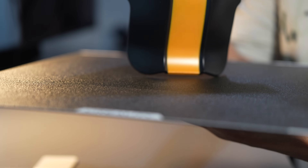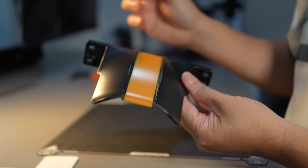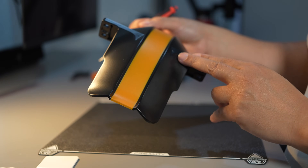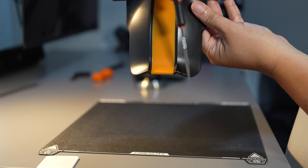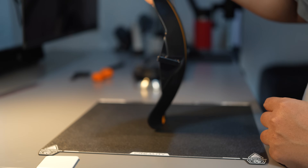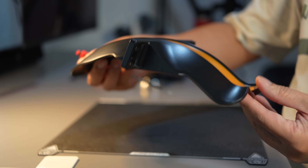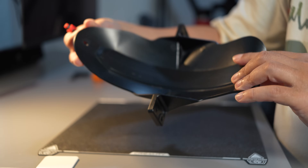If you look closely, this end of the mudguard is not flat. If the 3D scan comes out like a hundred percent, I would need to reverse this one in CAD to make a 3D print. But I would just use the slicer's modifier to add a flat base — a small one — so that it can sit upright on the print bed. So I changed my mind: this object does not require reversing in CAD for making a 3D print.